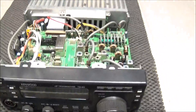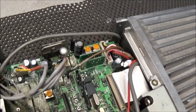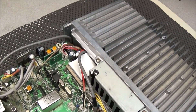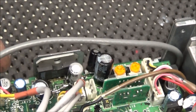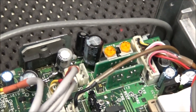I started looking and found a lot of problems on the TX-RX board. This radio uses surface mount technology and through-hole components. As I started looking, I found that these surface mount caps had leaked.